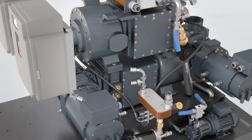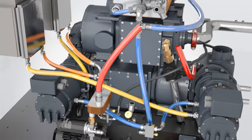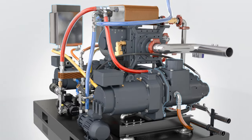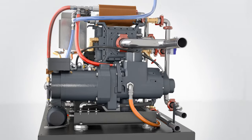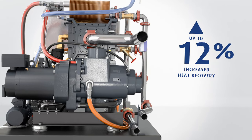By far, most of the energy used to run a compressor — up to 94% — goes to generating heat. That's an unavoidable thermodynamic fact, so it became a key part of Ultima's design that customers could easily make full use of this otherwise wasted energy. Heat is extracted from all the major components by a closed loop heat recovery system, taking heat from the motors, inverters, air-end jackets, and oil circuit. This means no risk of contamination from external water sources and up to 12% better overall heat recovery.